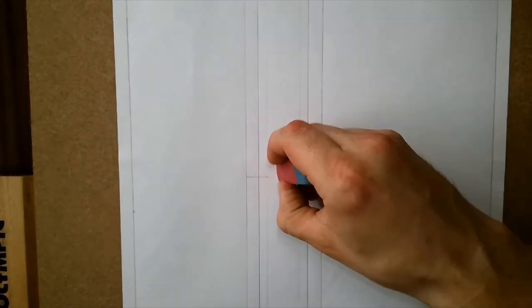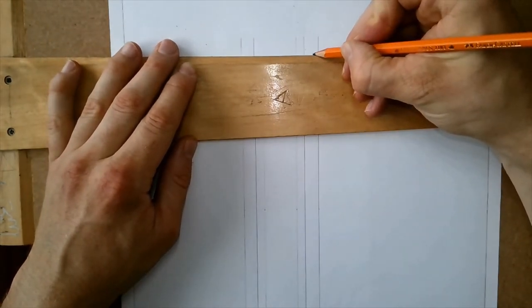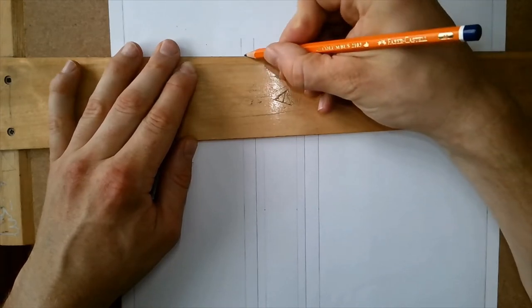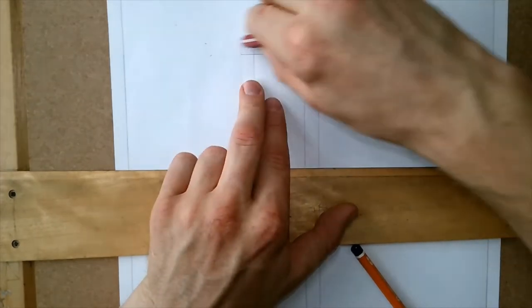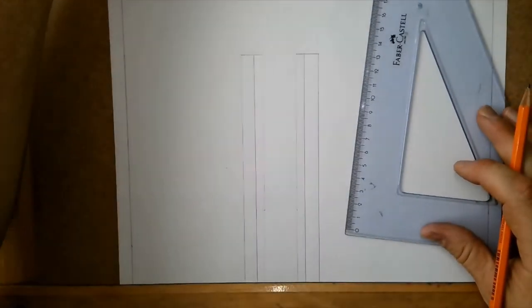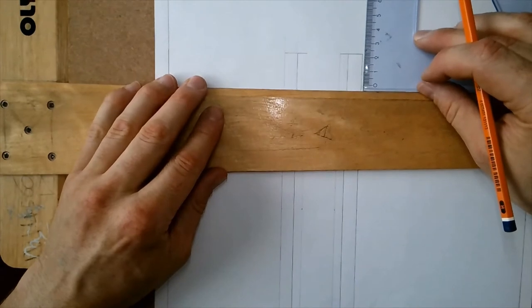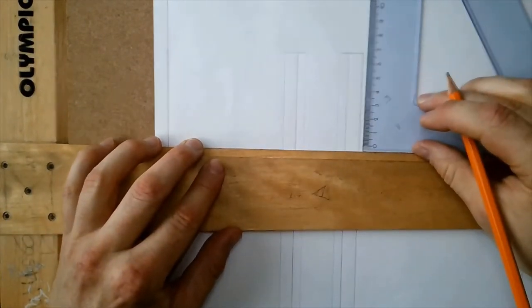That gives a guide for the size of the chimney — the width can vary; there could be extra cement on the sides or wider flue liners. Pick a position near the top of the page for the top of the block wall. Before going further, mark down the number of blocks — each block is 225mm in height, so 22mm at scale. Mark those positions down the drawing.